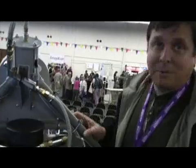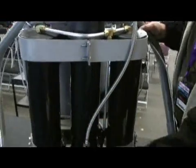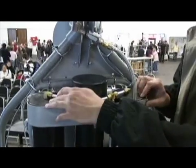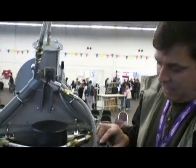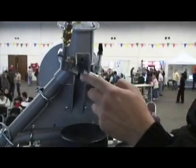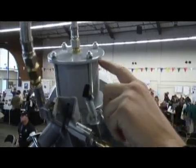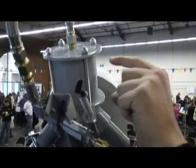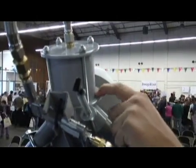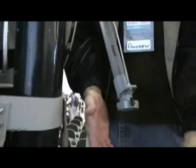And for your throttle, you have this control. The secret of a Rocket Belt is that it has a central tank of high pressure nitrogen. The high pressure nitrogen comes down, goes through a valve, comes around, and feeds these two tanks. These two tanks are filled with hydrogen peroxide. The hydrogen peroxide is pushed down by the gas and is collected by this manifold pipe, which comes up through a flexible hose to a valve. The valve meters the hydrogen peroxide into a catalyst chamber. The catalyst chamber is filled with silver screens — they look like window screens, they're made out of solid silver, and there's a stack of them in here. When the high pressure hydrogen peroxide hits these screens, it's decomposed from H2O2 into H2O plus O2, which is steam and gas. This gas expands many thousands of times from its liquid state into high pressure thrust that comes down these down tubes. The down tubes then allow the gas to escape and produce thrust that lifts you up.